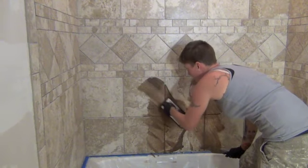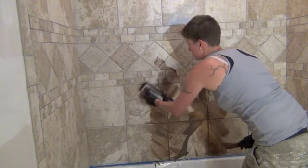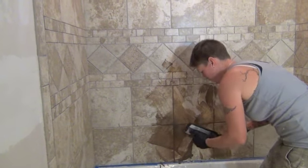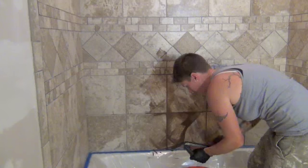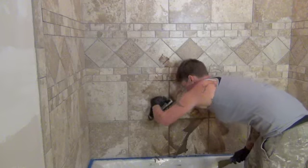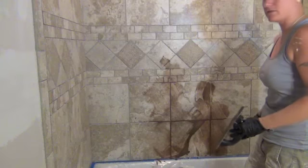You can cover more ground with the longer side of your trowel, but you get more pressure with the shorter side. So you go to 45, and when you want to clean off more of the grout, you go to about a 90, and it'll help you clear that off better. Alright, let's do the rest of the wall. Alright, Aunt Lori and I got it grouted pretty quick.